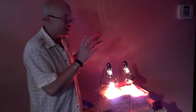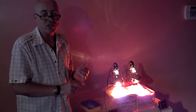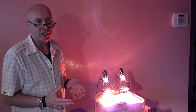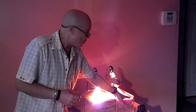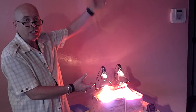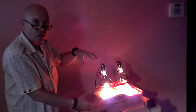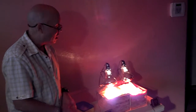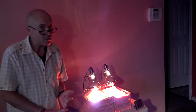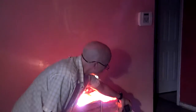Now, you can add more insulation if you want, but traditional insulation only blocks 10% of radiant heat. So if you add a lot of insulation, it doesn't matter. It may contain more, but once it's full and you add more heat to it, then it's coming out down into your house. It only stops 10% of the heat, whereas this stops 97%. Now, do you want to stop 10% or 97%? Makes a big difference.